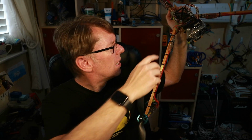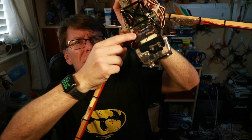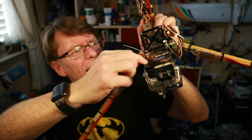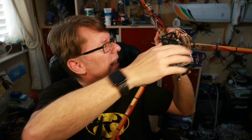We are looking at old 900 kV motors, ESCs that speak PWM, and this is the receiver, this quite large thing here, and it had 8 servo plugs in it, and it's got pretty large antennas either side. It's a big old beastie, and the videos of this thing flying are still on my channel if you go back to 2012 and have a look at it. That was a pretty good system. You could put that in a plane, you could use antenna extensions to put them in the right place. You'd get about 3.5 kilometers before you ran out of telemetry, and you'd still get a control signal past that.